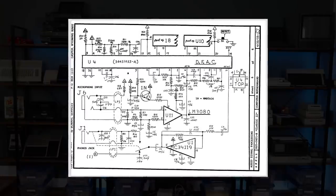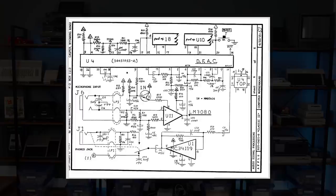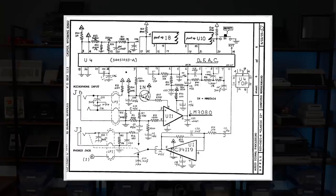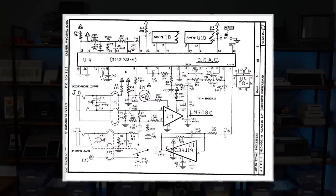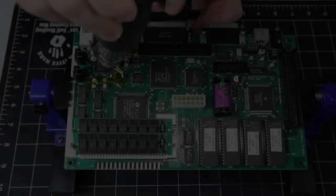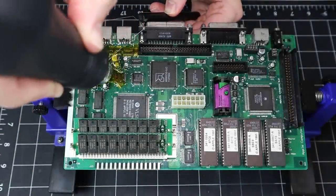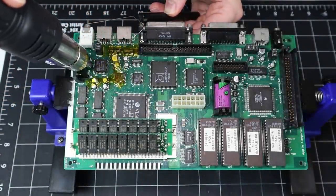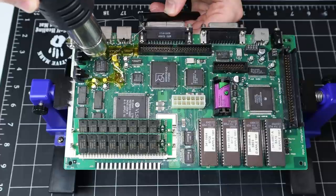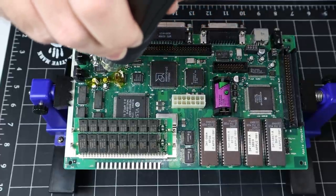This Classic 2 is nearly perfect now. The only remaining issue, no sound. I rechecked all the replacement caps, made sure all the pins on the audio and amplifier chips were clean, checked impedance of the speaker itself, and even tested the headphone jack. I couldn't find any obvious problems, so it could be a corroded solder joint or more electrolyte in places I couldn't clean. With that in mind, I'm going to break out the hot air station one more time and remove, clean, and re-solder the DFAC.